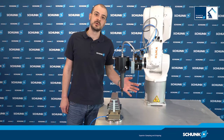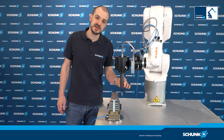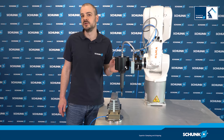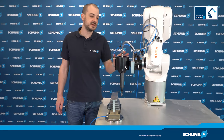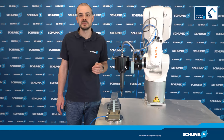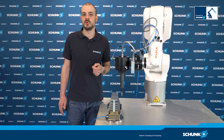The RCV cannot only be equipped with carbide cutters but also with other tools benefiting from the radial compliance mechanism and which are made for the 30,000 rpm. Here with our setup we can see this 3.4 kg unit mounted to a rather small robot, so you can also use it with different lightweight robots.